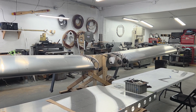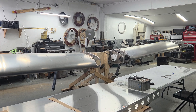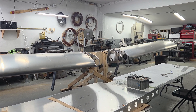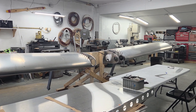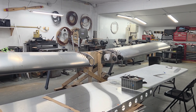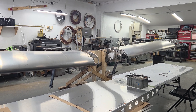We're probably not going to do a sandbag test for our initial testing — I mean, the wing is eight g's and we're never going to pull anywhere near that. After we fly the first airplane and get a little time on it, we will probably build a test wing and do a full-scale sandbag test. But with a design we know — it's the same airfoil, same basic spar, just stronger — I don't really have any concerns about that.